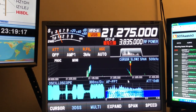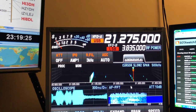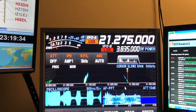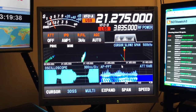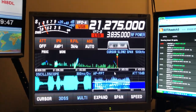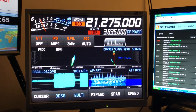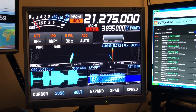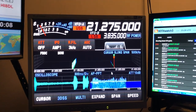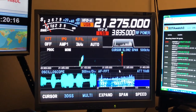So you see all that gain at the expense of the noise floor. Look at the meter — it's not moving much different. There's ZS6BKW. From about 2 a.m. or 3 a.m. till about 7 a.m. That's what I wanted you to see — just the differences between horizontally polarized, vertically polarized, and the amount of noise you're going to get. Sometimes the signal is not even better on the vertical. That can vary according to how far out they are. Verticals tend to be a lower angle of radiation, so they're good for DX. But I've got this ZS6BKW up high enough that for this band, it should be plenty high to also yield a low takeoff angle. I just wanted to jump in there with that one since I had shown you the ZS6BKW earlier before I used the tuner.